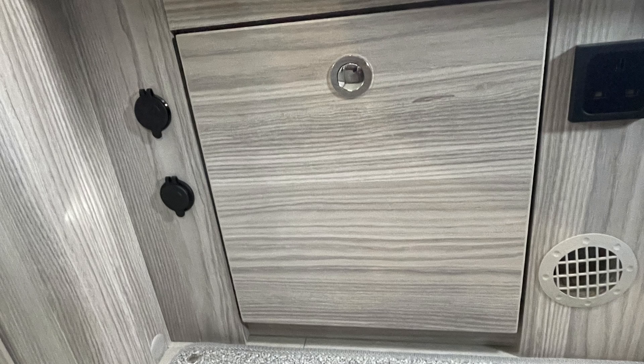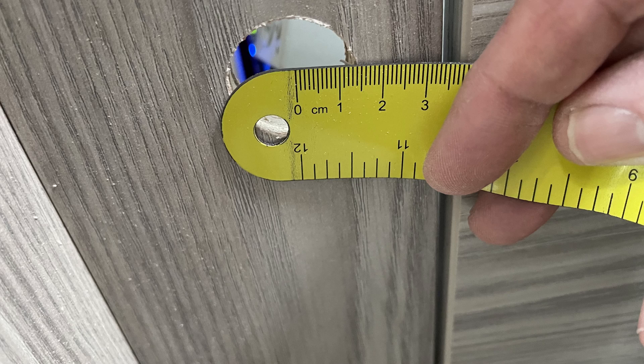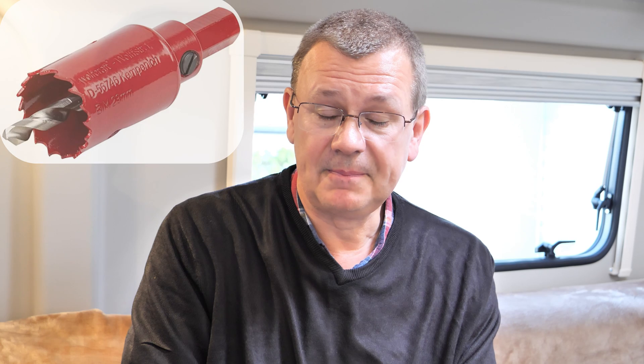The other socket sits roughly in the middle of where the vent and socket were, so they line up. I've slightly offset them — I could have moved them a bit more centred, but some framing for the bench and brackets were in the way. If I was drilling again I'd move them over just slightly. Once the hole is drilled, make sure everything's precise — I marked it up and used a 29mm hole drill.